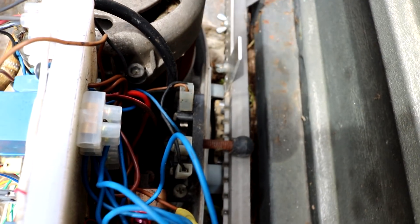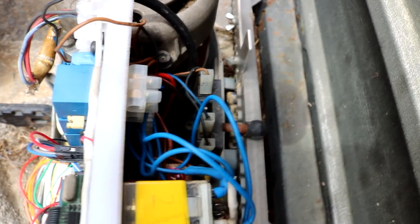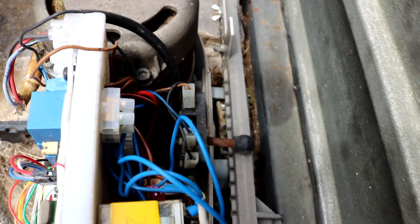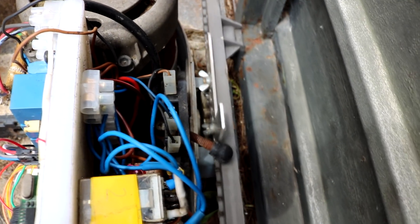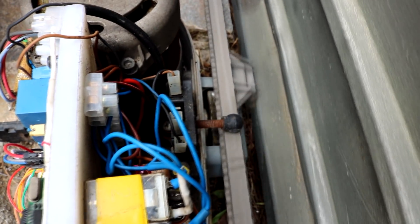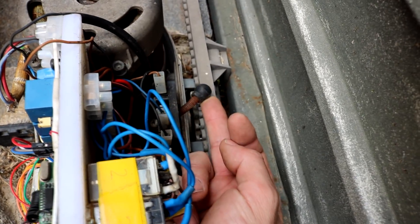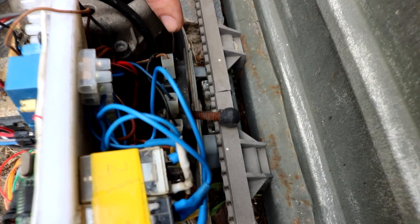For example, if you slide the door in that direction, this releases the micro switch — so this is the working position. But when the door is closed, the limit sensor for closing is activated. And the same way in the other direction: when the door is completely open, it will press another thing so that the other micro switch is activated, indicating to the Arduino that the door is completely opened.